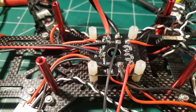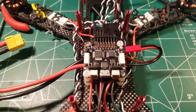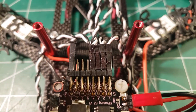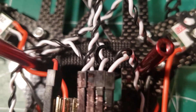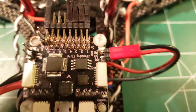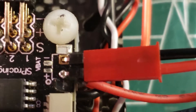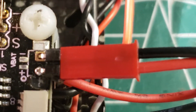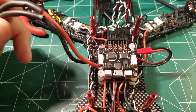Now it's just a matter of putting everything back together. I'm going to take this flight controller and put it back piggyback on top, then start reattaching everything. With my flight controller back in place and all my ESCs plugged back in, I'm double and triple checking polarity — making sure all my signal wires are on top. For the V bat I quadruple-check that I see the plus and the minus, with the red wire on plus and the black wire on minus.